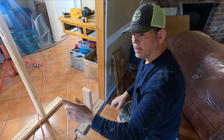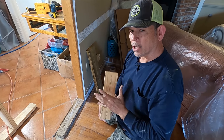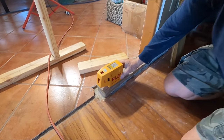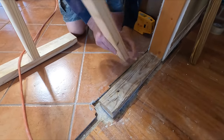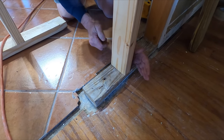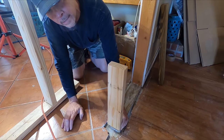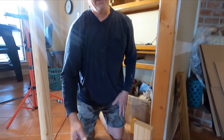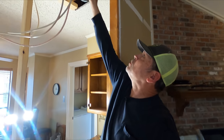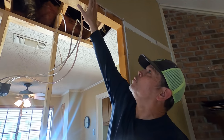Basically we're going to have five studs here and five studs on the other end. Five of these together measures about seven and three-quarter inches, but I'm going to call it eight. I used my dot laser to transfer the end of this bottom plate to my top plate. The reason I went eight inches back from here is because it's easier to build from this end back and cut off any extra rather than risk having the beam overhanging a little bit — you do not want that. So I measured eight inches back as my cut line for the top plates, and we'll make cuts at both ends and pull both plates down.